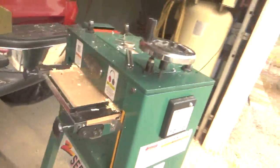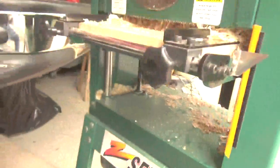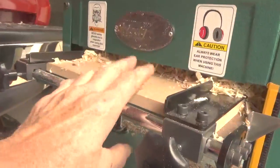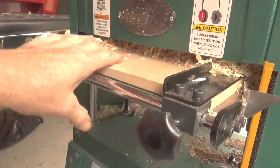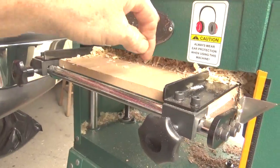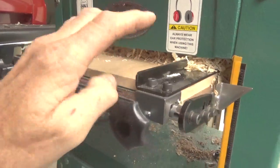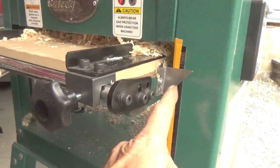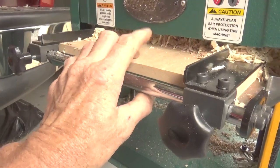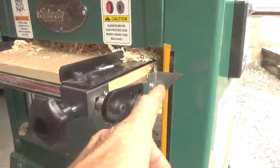Hey YouTube, I'm going to be going to a sawmill video, but what I just wanted to show was when you put a board underneath on this planer, and they recommend you put one on to do molding, because the cutter sometimes cuts into the table on the edge, which is fine, but when you put the board on, the scale is no longer any good. And the worst thing about that is, even with a piece of 1/2 inch MDF, you can't get the scale to work.